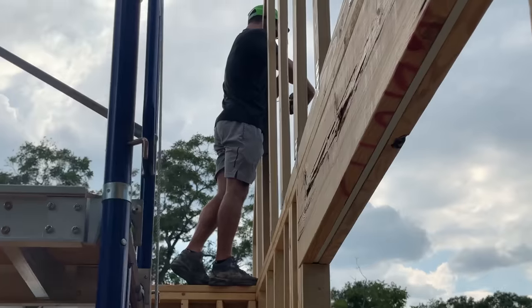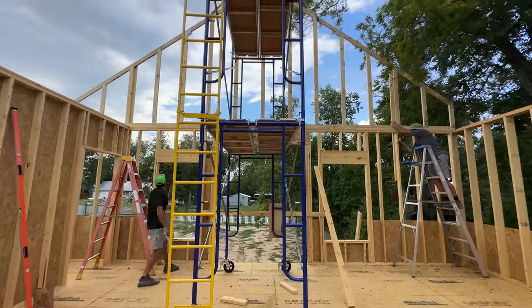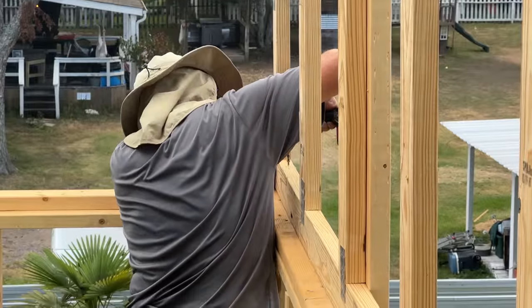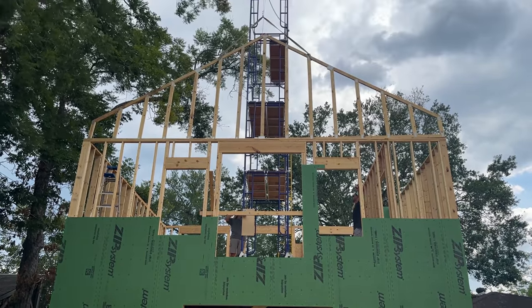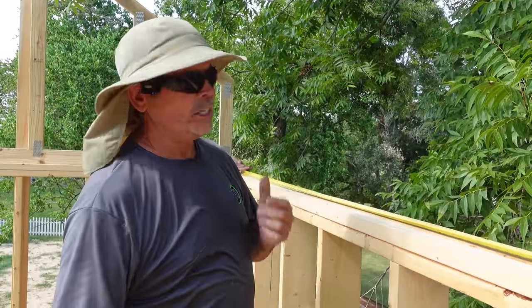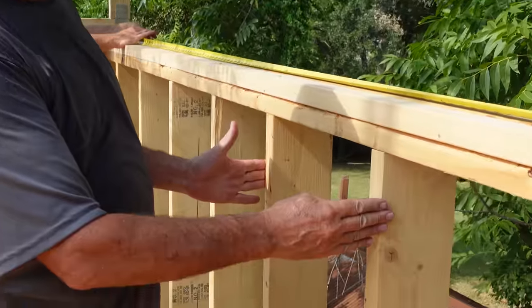Now what? All right, guys, our gable end truss is installed. 6-inch structural screws attaching it to the double top plates. That thing's not going anywhere. We also have it braced off, and we also are going to diagonally brace it before we leave here tonight. It's awesome seeing that thing finally in the sky. So now we're going to put up the parallel chord trusses. We got to lay it out 16 inches on center, and couldn't be any easier. Our studs are also 16 inch on center.